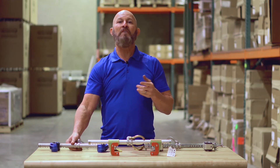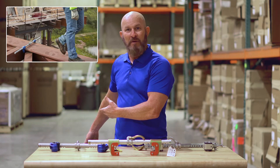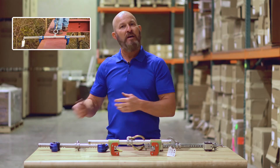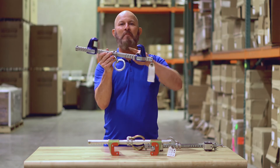Why is this important? Well, if I'm walking on structural steel and my anchor point is behind me, the last thing I want is to catch on something with a chatter. Keep it in the middle, it'll trail you nice and easily, and this one also has that mylar in the middle.